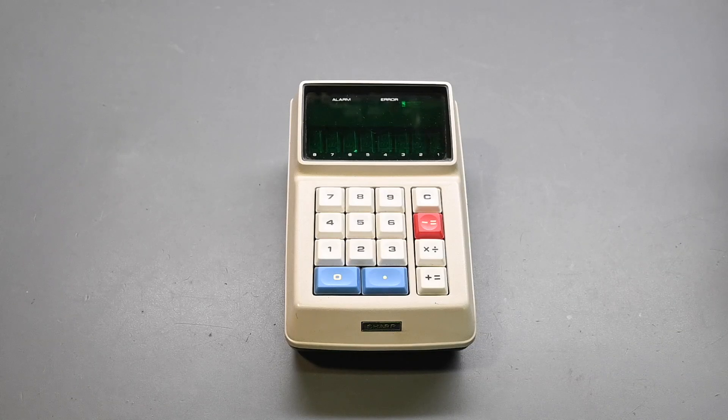Something very noticeable on these calculators when turned on is the display. It uses a vacuum fluorescent display, which is a very common type of technology. But the numerals are almost like a handwritten style — they were known as an i-tron tube, and they use a very unusual half-height zero. They have a very unique look, very different than the seven-segment type display we're familiar with nowadays.